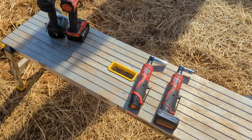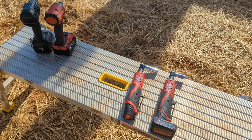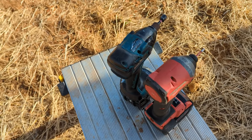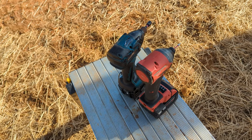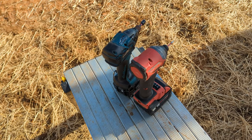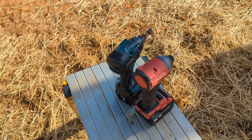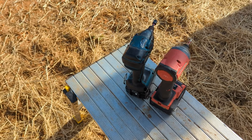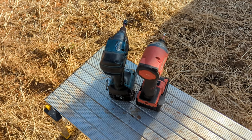We're going to talk clamping, but first let's talk tools. You might have learned the hard way — these are not the tools to use. Do not use an impact, even though you can put a socket on it. If you think you're saving time with an impact, you're not. Someone on the crew will not feel what they're doing and bust the panel. There's too much power, too much torque — you're going to break glass.